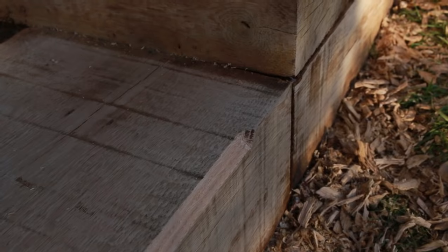I didn't get loads of footage of that sanding because my other camera had packed up and I didn't have a tripod for this one, plus I didn't want to get dust all over them. But what I've done is taken them down from 50 grit to 80 grit to 120 grit, focusing mainly on the top sleeper because that's going to be our most visible finished surface — and also the one that people might sit on. I've also used the router with a chamfer bit all the way around the outside to take the edge off.